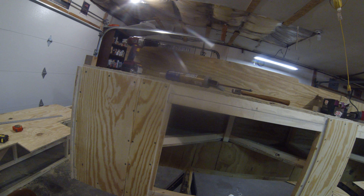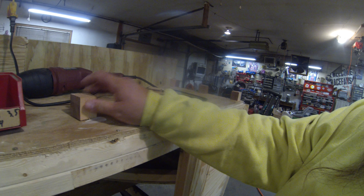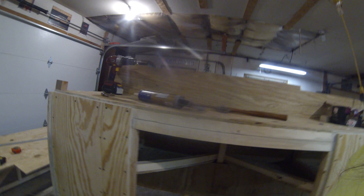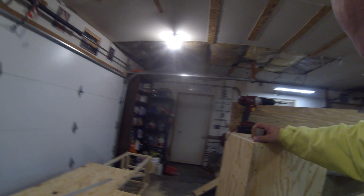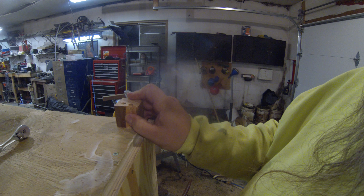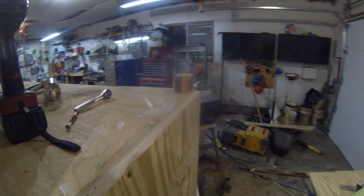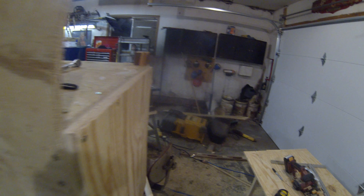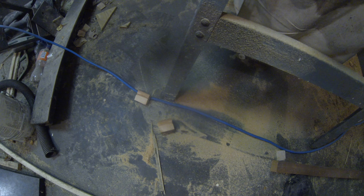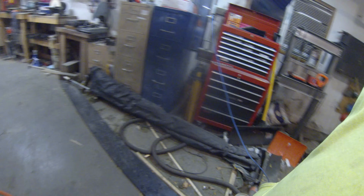I suppose I'll fill that, but it's still going to show. So I cut a bunch of squares to use as spacers on the floor. You can see how I screwed that one and it split a piece out — I re-screwed it, you can see the hole here. I put in another one and that one split too. So apparently they need to be pre-drilled.